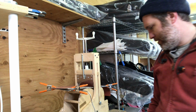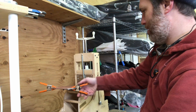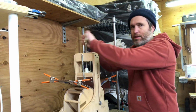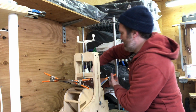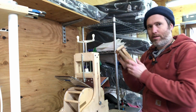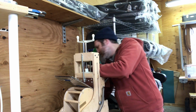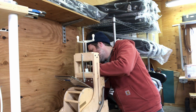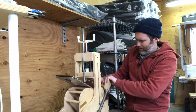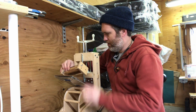Okay, so now I'm at as hot as I want to get, about 225. And so I'll take the thermometer out. I'll do the waist first. Now the spring clamps. Now these are held on by these springs on the side. There, so that just bent the upper bout. Now I'll do the lower bout.